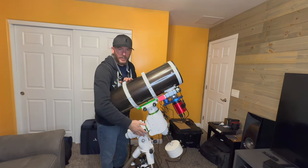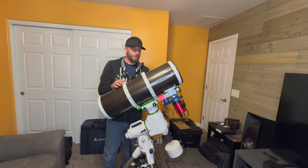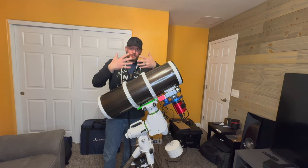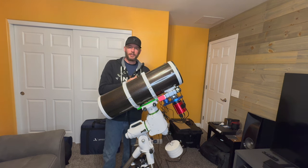Your RA and declination have worm gears, okay? And gears, as you know, have teeth. And those teeth have what's called backlash, which is spacing between the teeth when they contact each other. That backlash needs to be there to keep those gears from eating themselves alive.